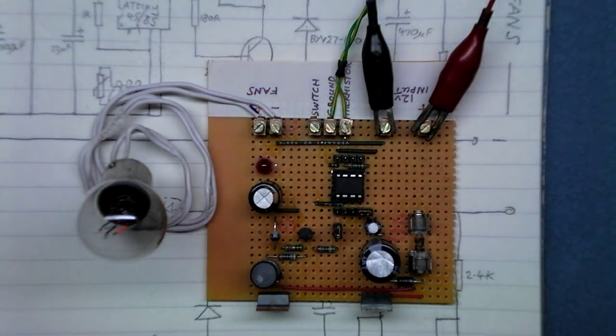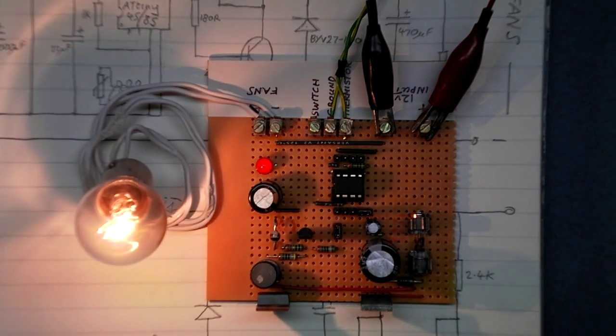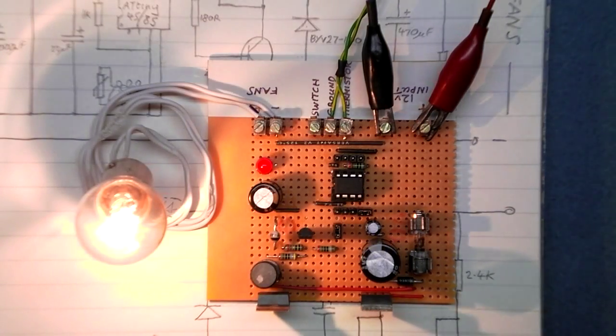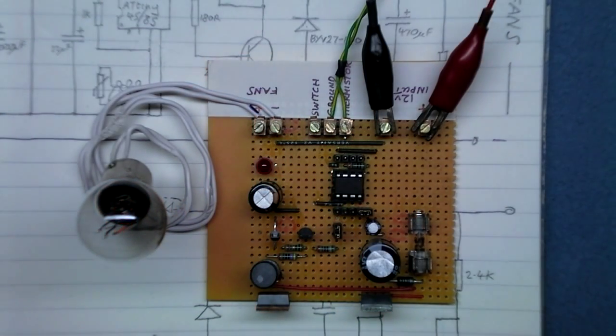But obviously when you go into the shower, I wanted the fans to automatically run at full pelt to extract the steam. So I came up with the idea of using an ATtiny pulse width modulated switching regulator to control the fans, and this is what I did. It's a straightforward PWM circuit, really.